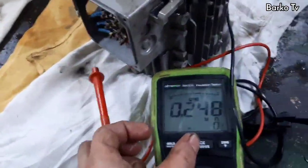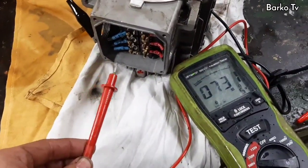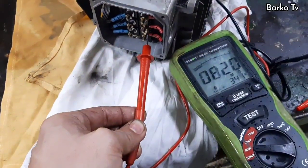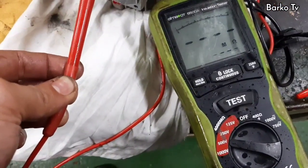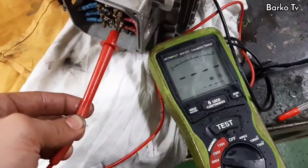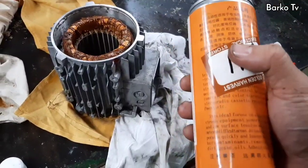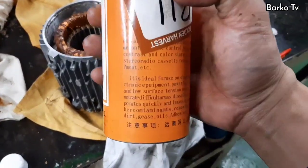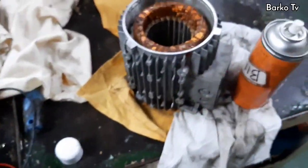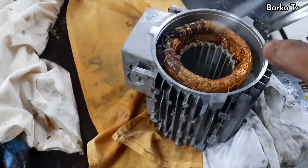We need to test this motor with an IR tester so that you can see the reading. Normally in this situation the reading is still low — the IR meter reads 0.2 mega-ohms. We then spray with a quick dry electrical contact cleaner. This quick dry electrical contact cleaner is ideally used for electronics, powerfully removes moisture, dissolves quickly, and leaves no residue, contaminants, moisture, or oil as per the bottle description.